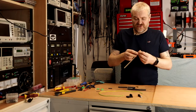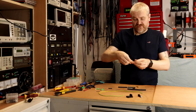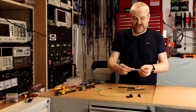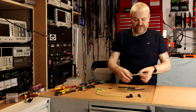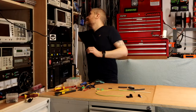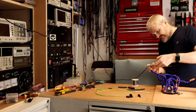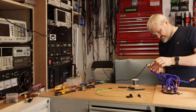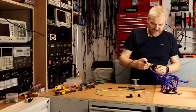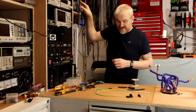First of all we're going to work out where everything's going. The copper wire will come down to about halfway where it's going to join the conductor of the resistor, which is going to be near the end, and then the wire will go on after that. So first I'm going to attach the copper wire and the resistor together. You want to make sure this is a decent connection because obviously this is where the capacitor is going to discharge through. That's a good connection, and then we're going to need to do the same to the silicon wire.